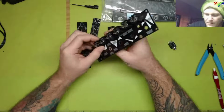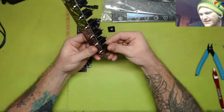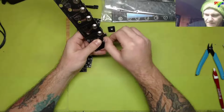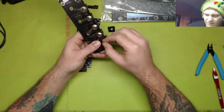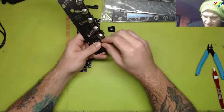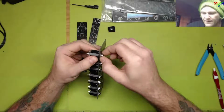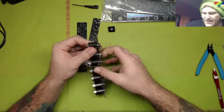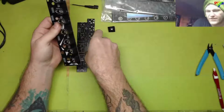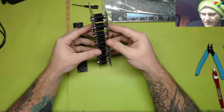It doesn't actually do any tuning, but you could then write the code in Arduino to set a reference voltage, right? To set a potentiometer to a certain correspondence. Like, okay, let's say the main oscillator Arduino is reading a C, and you want everything to be a C. So you send one of those outputs to the sub Arduinos and say, hey, adjust until the output that you're reading says C. You see what I'm saying? So the main Arduino is telling the slave Arduino which tuning to go to on its digital potentiometer, rather than individually tuning them with one knob.